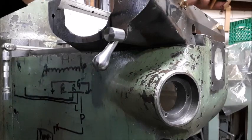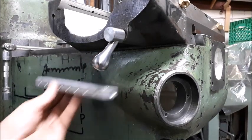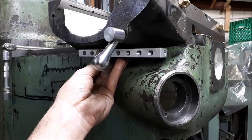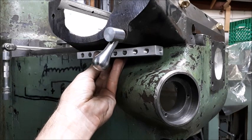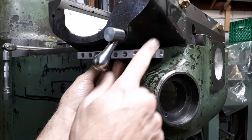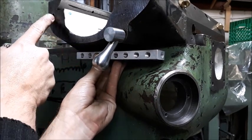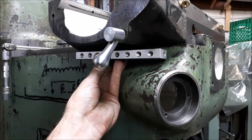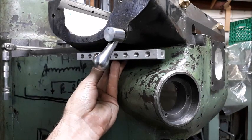You can see here we've got fittings for everything. I've got brass and I'm going to go hard pipe. I've got a distribution block here that's probably one of the first things I want to mount - on this side, which is the standard side. These two fittings will supply the two on this end, the ones at the far end will supply this side of the saddle and the lead screw, and the middle three will go across to feed the other side of the saddle.